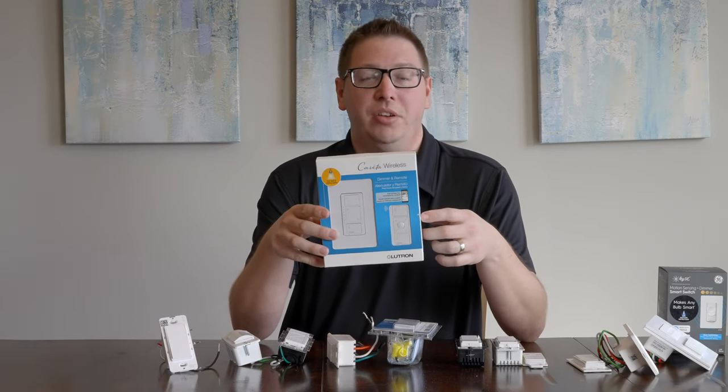But if you do have that neutral wire, you've got a lot more options to choose from. A lot of these switches have that white wire. A fan typically is definitely going to require a neutral wire just so it has that extra load capacity. Some of the switches are going to be able to connect to a second or third switch and use the traveler wire, working with the dummy switch. Some will have what's called an add-on switch that goes into the extra spots. Check the box and the manufacturer's instructions for how to set up those different configurations.